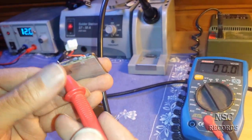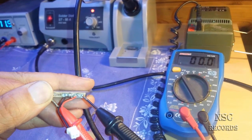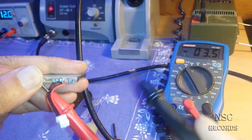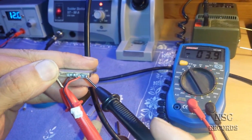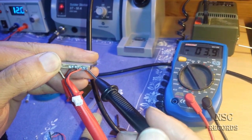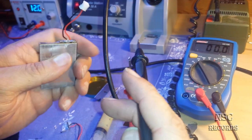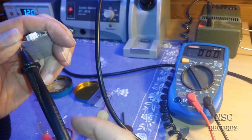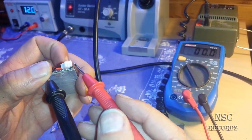You can hold the multimeter on both sides — and there you can see the minus reading. If you see a minus reading that means you need to turn it around. Take care that you have the correct contact polarity, otherwise the batteries will run hot, and that's not good because they could explode.